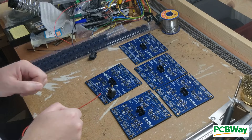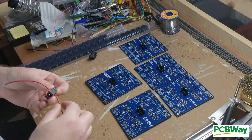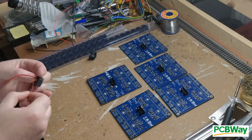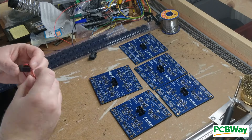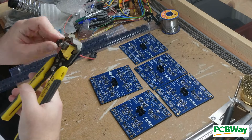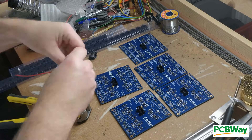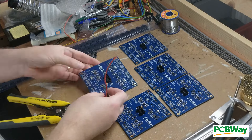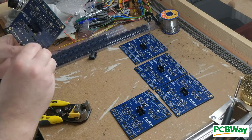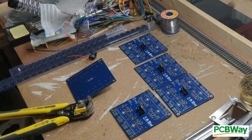Most of the assembly is already complete, but I still do need to wind the current transformers. The current transformers are created by passing two turns of wire through the centre of the coil. There are a couple of notches in the bottom of the coil, and it makes a neat installation to use them, but it's not strictly necessary. I'm using the same stranded wire I used to wire the track up with. There's no reason this has to be stranded wire — a sufficiently large piece of solid core would have been fine. I just don't have any to hand, and I've got plenty of the wire I do use to wire the track up with, including some conveniently sized offcuts.